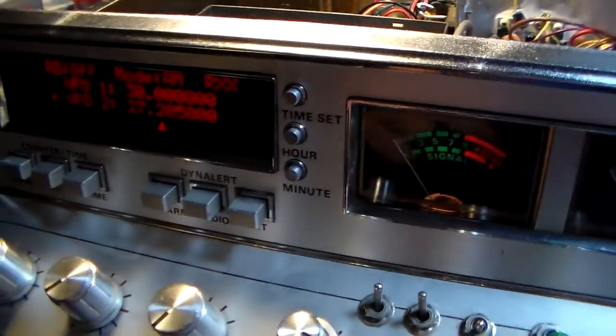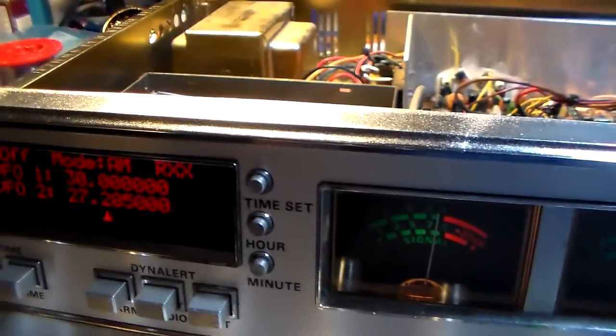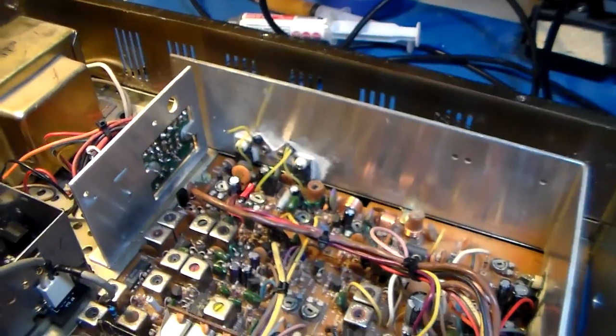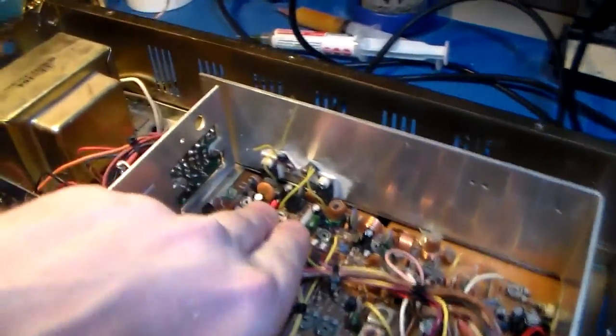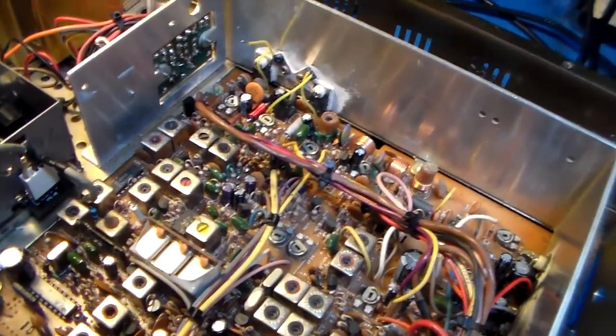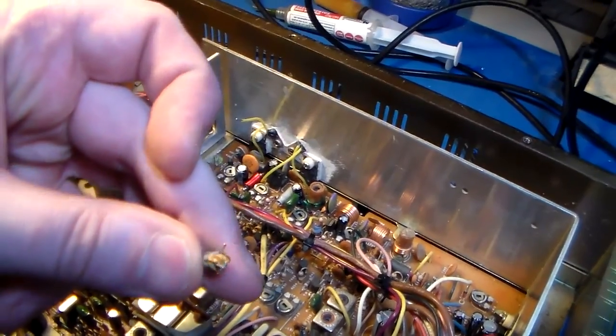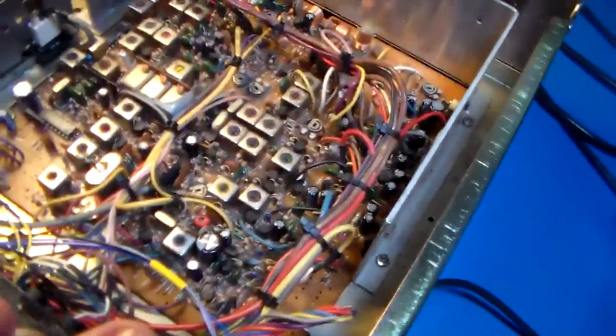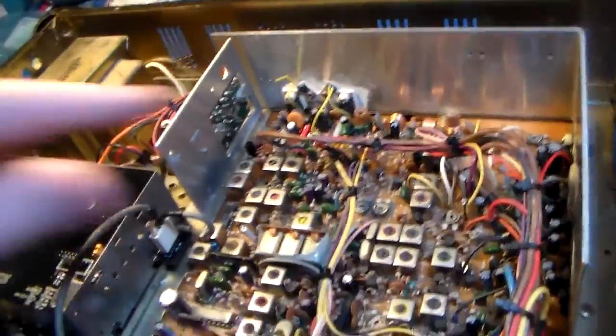Now, of course, on channel 20 we have good output. Well, we have as good of output as we're going to get with this screwed up, which is about 3.5 watts tops. I think these guys took a beating, and they probably need to be replaced, especially with the inductor getting smoked, and this is shorted, and had a bad cap in here, had some glue. You end up with stuff like this where you got the glue chunks underneath the caps, and yeah, you end up with problems. I did replace some caps initially, and there's the rest. A lot of the little guys I just didn't do. So everything's been replaced. The only one that hasn't been replaced is that one down there, and that's because I really don't keep caps that big. So I need to get one of those. I need to figure out this MV1Y situation.